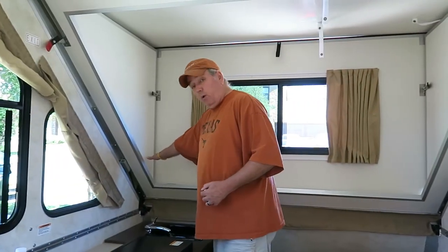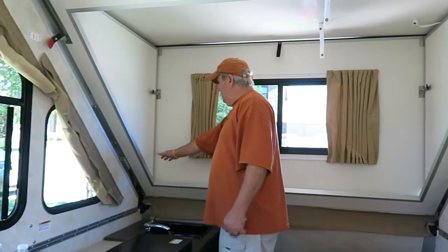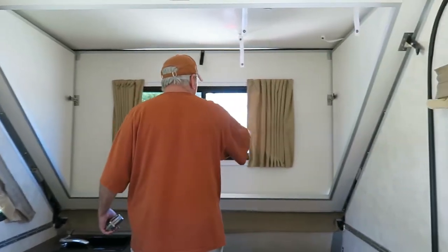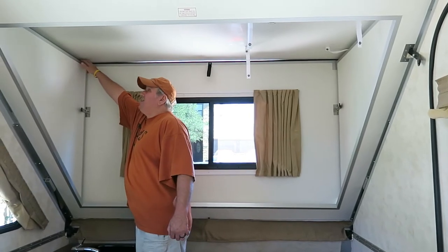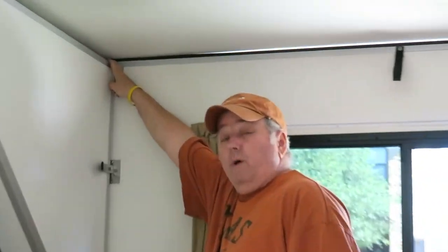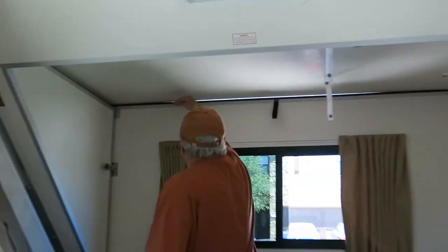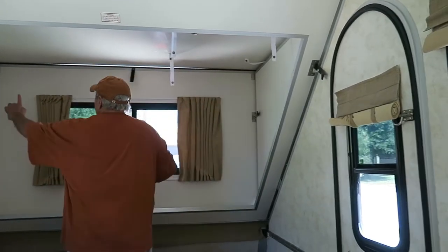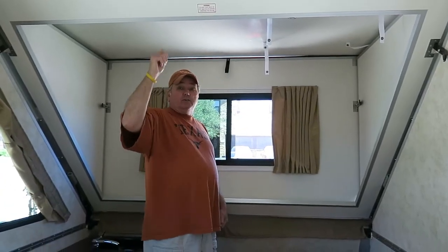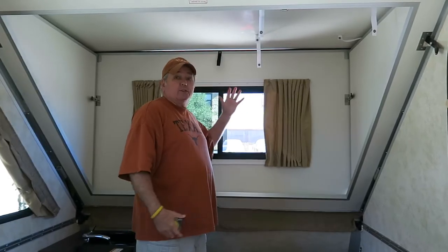Once we've got the corner pieces, we can just put a flat eight-inch board across here for one shelf. Then we can come up and make another shelf there. Up here at the top, we've got about an inch and a half gap. I'm going to take a one-by-six, approximately 78 inches long, and get it to sit flat across here. In the bottom of it, we're going to put some hooks where we can hang coffee mugs, spatulas, large serving spoons, and pots and pans.